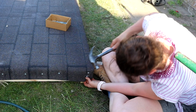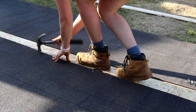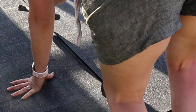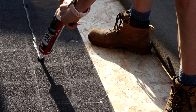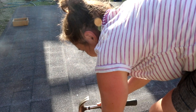I matched up the pattern and ran a line of bitumen adhesive where the lines start, then a zigzag. I overlapped the next felt and did a fancy foot shuffle. More clout nails went across, and after nailing down the opposite end, we repeated using the adhesive with the other overlap section.